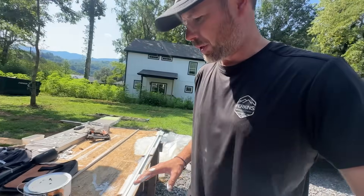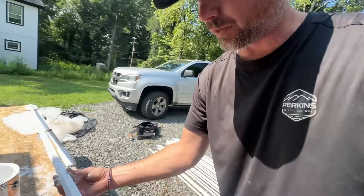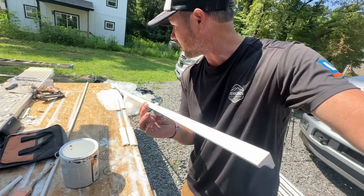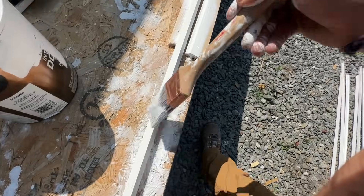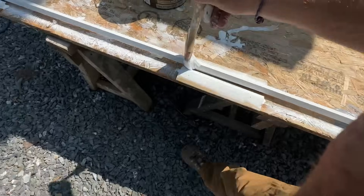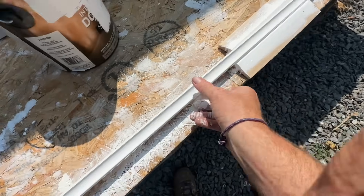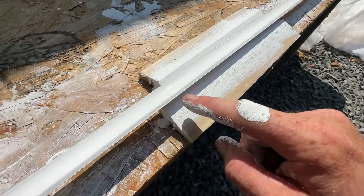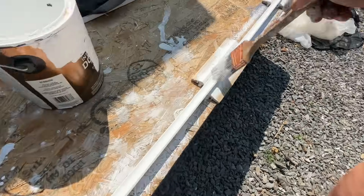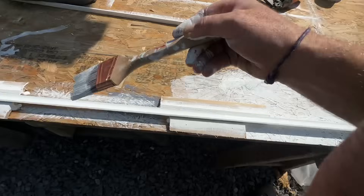A really important thing I'm doing to make sure the surface has a good paint job is to brush the back of it. After painting the surface, the back has a little lip of paint that's going to keep it from going tight to the wall. So I'm taking the brush and smoothing that on the backside, but when I do that it makes a little lip on the front side, so I've got to flip it back and hit the front side again. That's what it takes to get a nice paint job on one side of a surface like this.